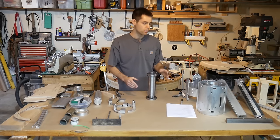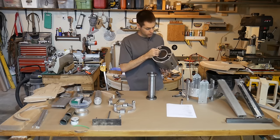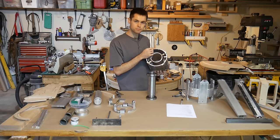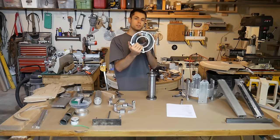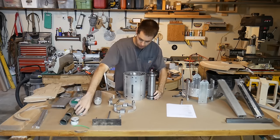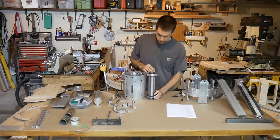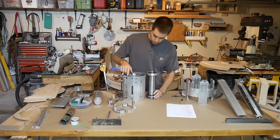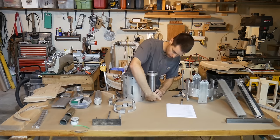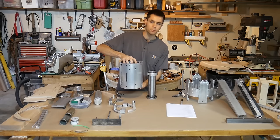We need a way to hold these bearings in place, and what we're going to use for that is this hub — the main hub for the table. The center is a 4½ inch quarter-wall aluminum pipe, the outside is 8-inch quarter-wall pipe. In the center I have a flange at the bottom that the bearing sits in. Then we have this piece which also has a lip on it, and that slips over the top. We have some screws with truss heads and washers that compress down on this while pulling up on the bottom, and that enables our hub to spin like that.